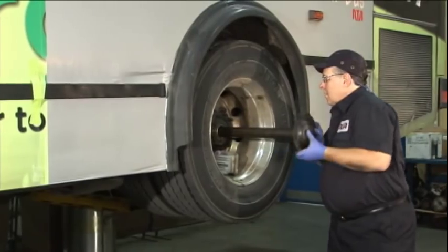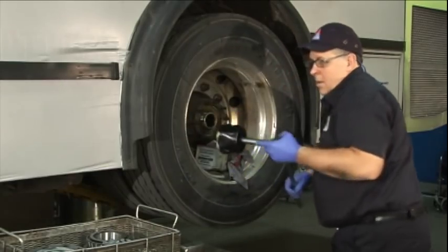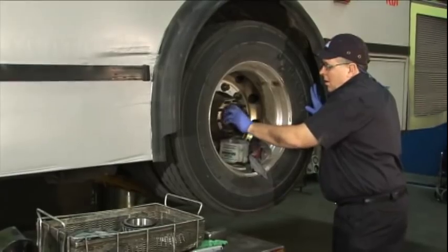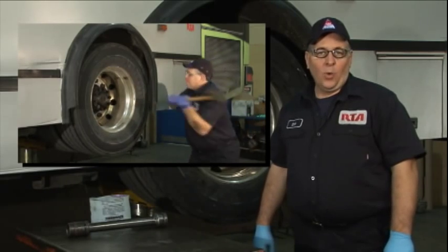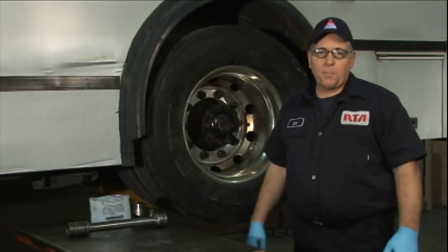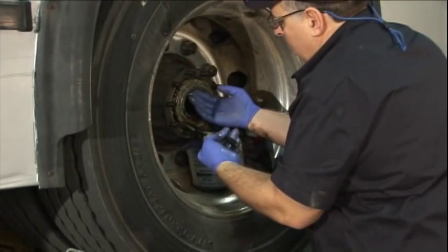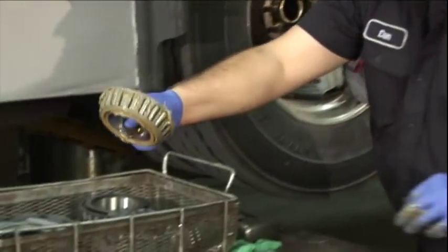Removal of the wheels is the first major task. This involves setting brake adjustments at all brake positions, removing slack adjusters, camshaft mounting bolts, and fixed-point hardware. The coach will need to be lowered to the appropriate height to perform some of these tasks. When removing the rear axle, it's important to use your brass hammer to avoid any steel-on-steel contact. Using a steel hammer can cause chipping of parts, sparks flying, and debris. Many of the parts removed may be cleaned and reused — place these in the basket for cleaning and clean all gasket surfaces.